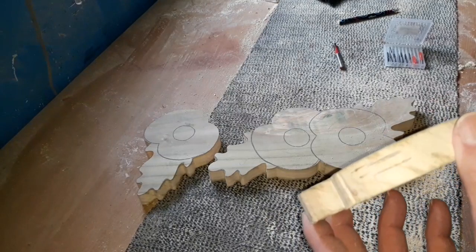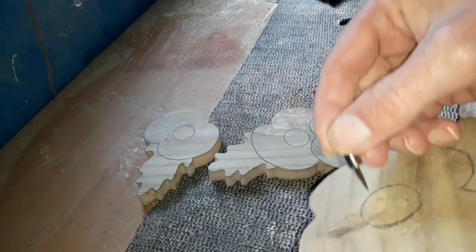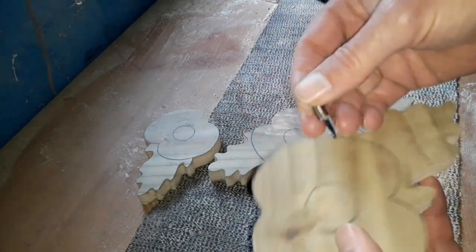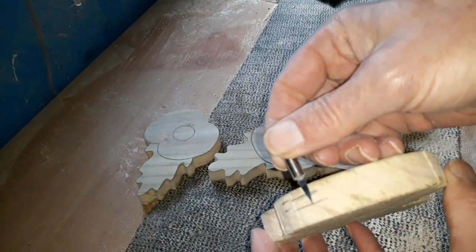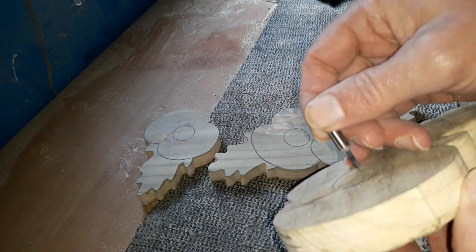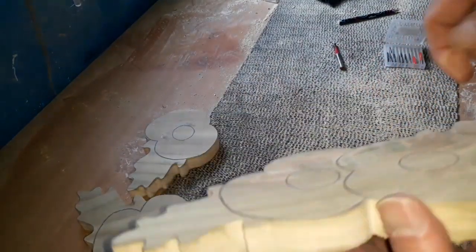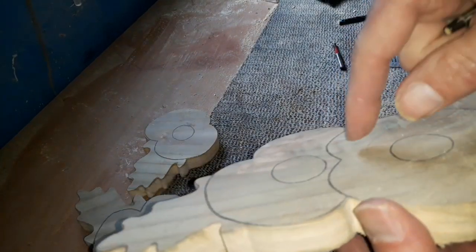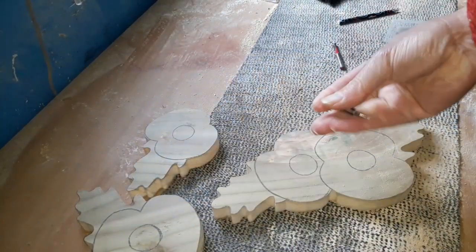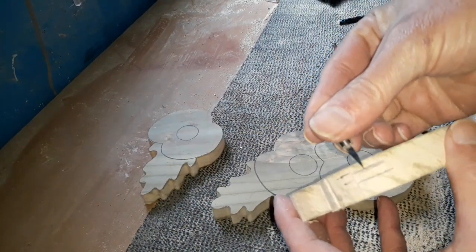I've set a pre-depth marker. We'll set the router to the first line and go around all the circles, then set it to the next marker and go around the outer bit. The second marker is deeper so that will lower the leaves down deeper. The first mark is not so deep — that will just lower down the poppy to the black center. On the double one the red poppy will be slightly higher than the other, so we'll just trim that down a little to give the difference in the two depths. We'll set this up in the router and start on our first mark.